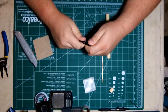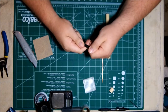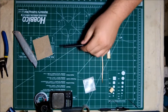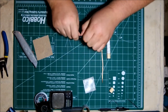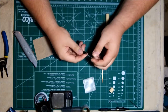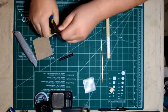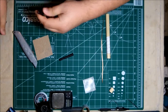Let's go ahead and take apart our whip. It's hinged, and if you twist on it sideways where it's hinged, it'll pop that hinge and break free. However, the end is still captured. So if you look up the antenna a bit, you'll see that it's a seam on it, and we can break it at that seam, which exposes the end of the antenna and actually has a metal dipole, I believe is what it's called, a half dipole. And we're just going to cut that, and that'll allow me to pull the rest of the wire out clean.